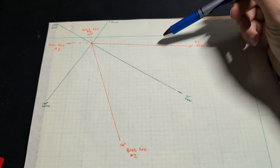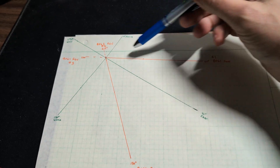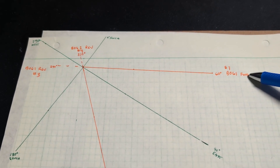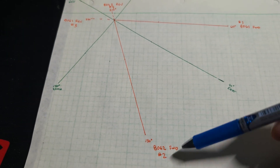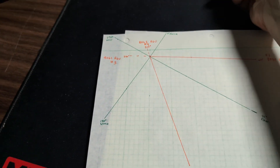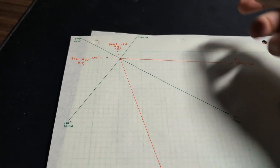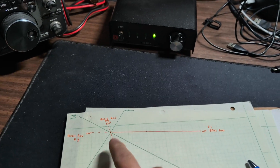Here's the layout of the yard. The back fence has BOG element one running along the bottom row, and the side fence has BOG element two running along its bottom. When BOG one is forward, it's pointing at 60 degrees; when it's reversed, it's pointing 240 degrees. BOG two forward is 130 degrees and reverse is 310 degrees. I have these wired up so I can go around the compass using my switch — position one, two, three, four — covering all four directions.